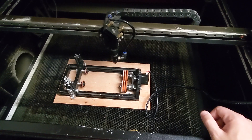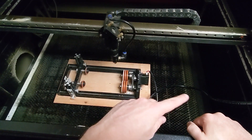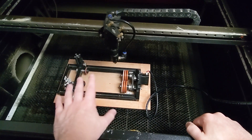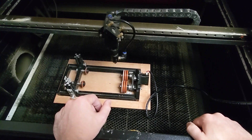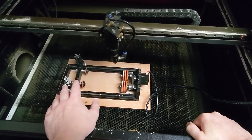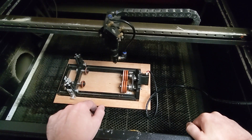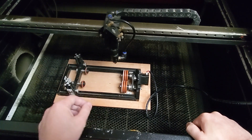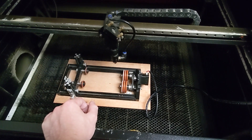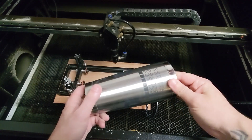A few notes about this setup: I am using a standard rotary tool for CO2 lasers, wired in to use the Y-axis instead of the gantry — nothing fancy, just a regular rotary tool. You do not need to use this on a rotary tool; it works on anything, even flat metals, from aluminum to copper and brass and more. That's one of the things that makes Brilliance one of the better Cermark-type companies. Also, if you're just getting started with Brilliance, I definitely recommend using a test cup.